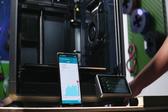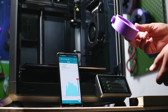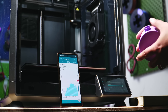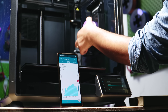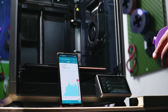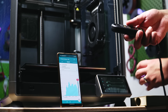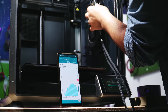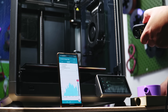We got about 67 or 68 decibels in total — that is where we stand with the side fan. For all future noise tests I'm going to keep my phone here for accuracy. Now we're testing the redesign I did of Simon's baffle, and we're down to about 63 decibels. But I really don't like where it's going because I can hear that the fan is starting to struggle. Let's test that — I have an air speed meter here. I'm going to test it to see what its full speed is without the baffle: we're getting about 7.5 meters per second.